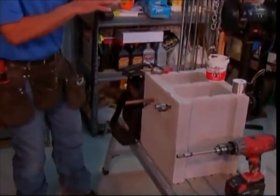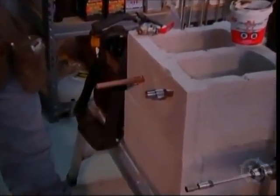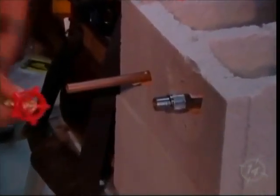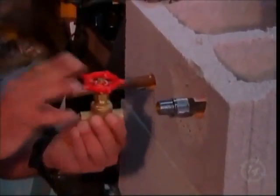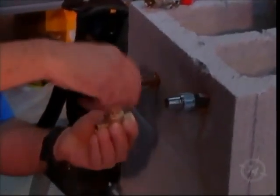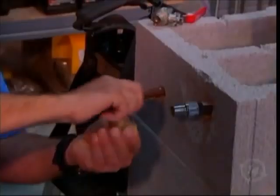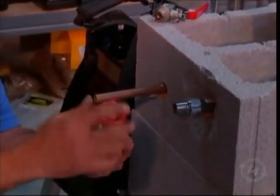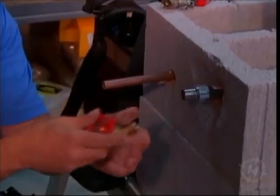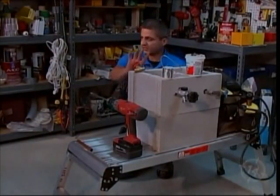Now, just like the whole reason that we chose a ball valve and not a gate valve, you're now left with the same choice on the inside. Do you want to install a gate valve, which again, you've got to turn and turn and turn, and then keep turning? And again, if it's over-squeezed, it will end up leaking. But obviously now with the frost-free unit, this doesn't apply.